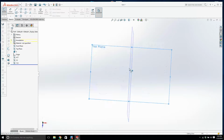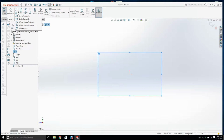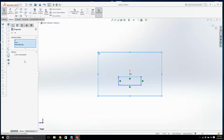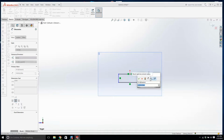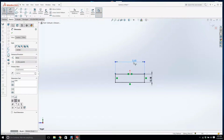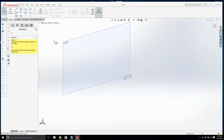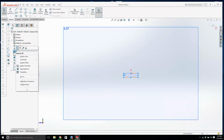and let's create a sketch on here. Let's try that again. Okay, and what is it going to be? We're going to draw a rectangle. I'm going to draw a corner rectangle like so. The top of the fork is going to be the origin, the origin here, midpoint. The thickness of the fork we said was 0.175, and this is 0.688. 0.81. Okay. Now you're probably saying to yourself, well, the bottom of that fork is round. We're going to add fillets later, I hope. Okay, we got that. Let's turn this on. And we're going to turn this sketch off. And I'll turn this plane off.